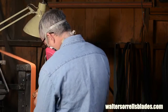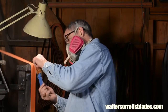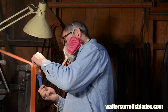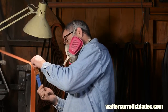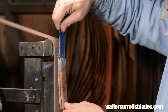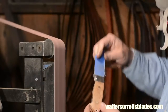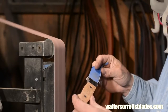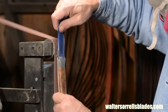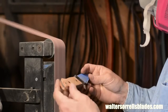What will happen if you just blast away, not really paying attention to the effect on the wood versus the metal, is that you'll cause dips where the wood is, and all the metal bits will kind of stick up, creating this wavy, dippy effect. Not good. So, what I like to do is run the blade down the face of the grinder. This will force the belt to engage all the hard steel bits on every grinding pass, preventing the belt from accidentally digging into the wood and creating a major dip. Basically, I just keep crunching away at this point.